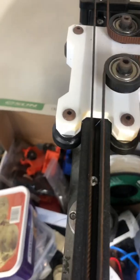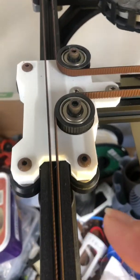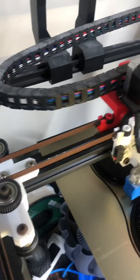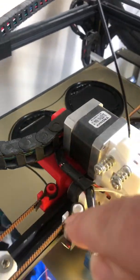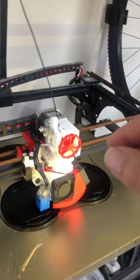These are still quite nasty rollers — I still don't like them. It's difficult to get them to reliably roll; there's always one that won't roll. If you have eccentric nuts, you can tighten them all at regular intervals. I didn't bother with eccentric nuts and I sort of regret that a little now. Coza Maker's design in particular — I admire the way the belts are fastened, because it's very easy to pop these off and re-tension the belt. If you do that, remember to do it with the gantry parallel to the frame — bring it all the way to the front and strap it on with cable ties, then set the belts. That way you ensure it's nice and square.